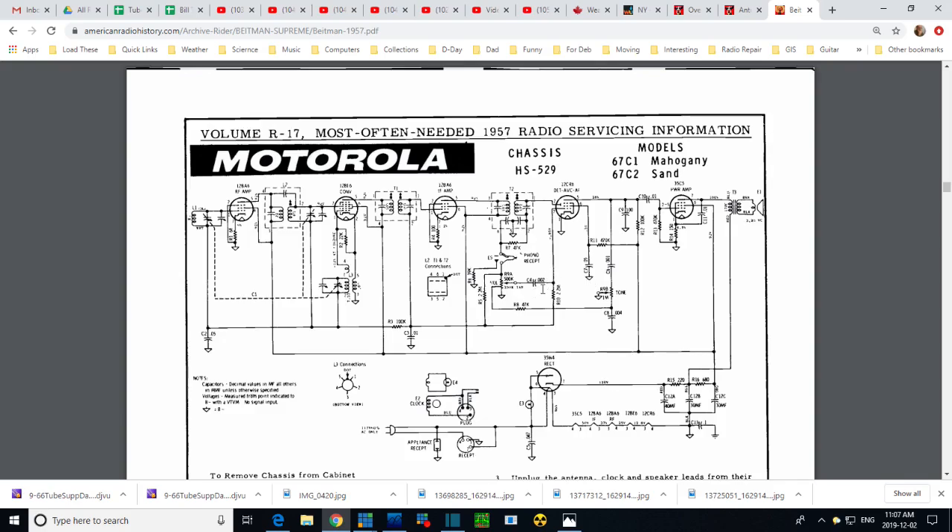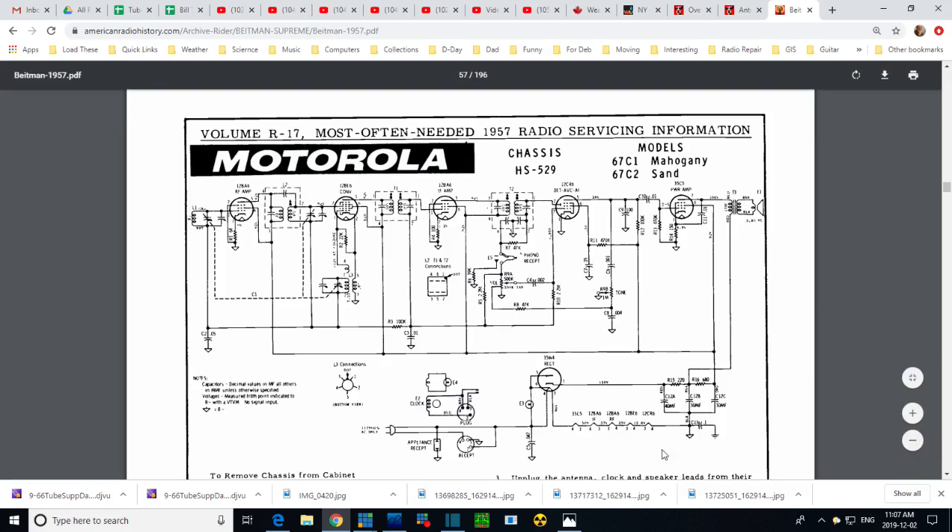The DC will show up on the other side of the capacitor anyway through an unusual circuit in this radio. This radio is advertised as being 'Volumatic' — a registered trademark. All these radios have an automatic volume control, and this one has two — one of which is done in the audio section, which is a little unusual. That DC voltage on this wire feeds through a huge resistor onto the grids.